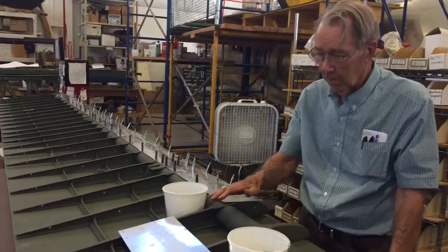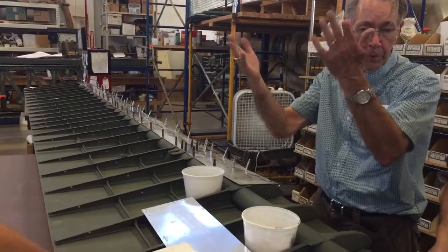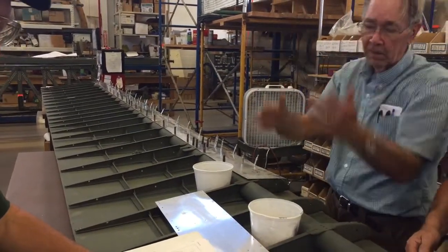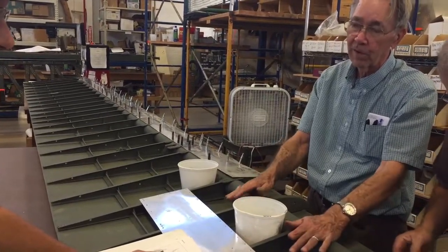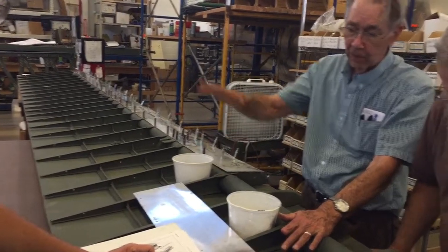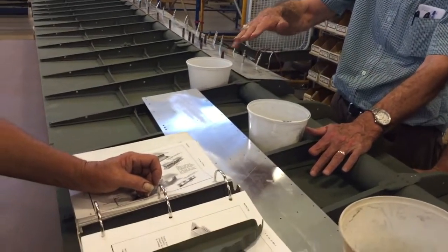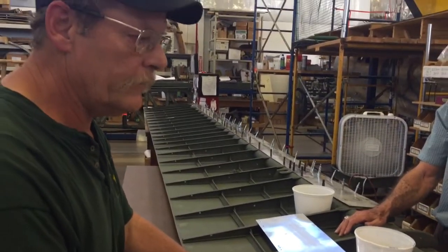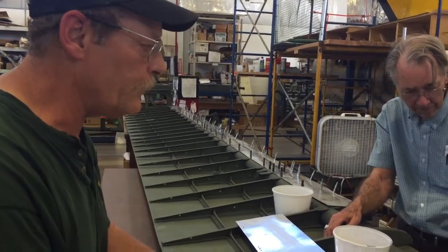This is the top surface, which is unskinned. So when the plane's in flight, this is folded up into the wing, so we don't need an aerodynamic surface here. The underside is the aerodynamic surface. When landing or taking off, this is folded down and provides additional lift at low speed. Yep — it increases wing area and changes the low pressure point on the airfoil. Increased lift.